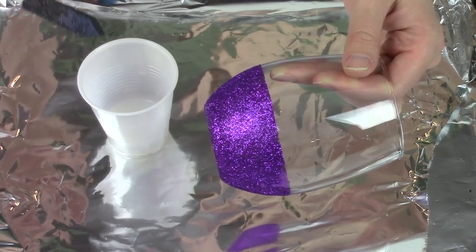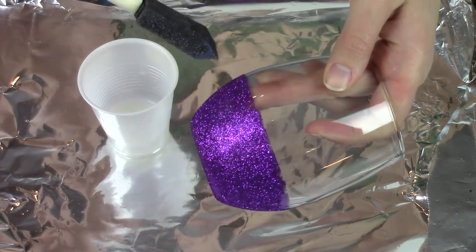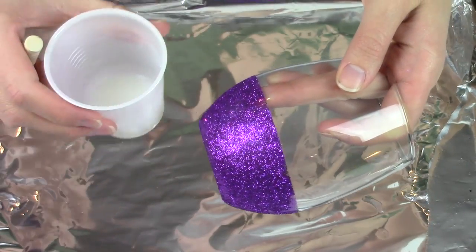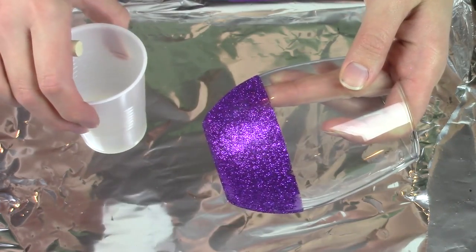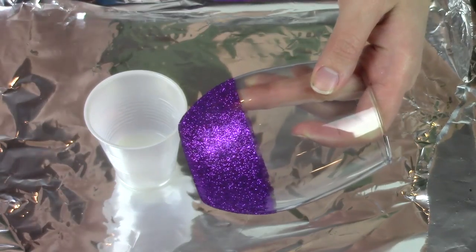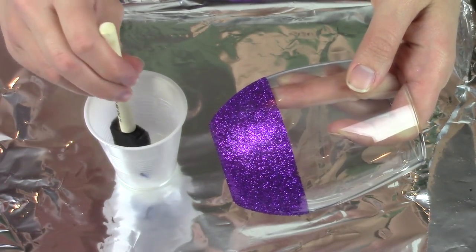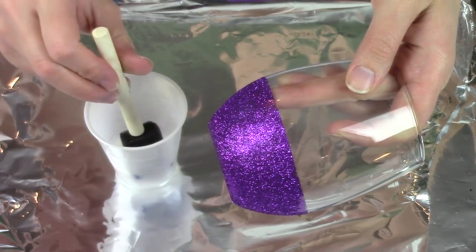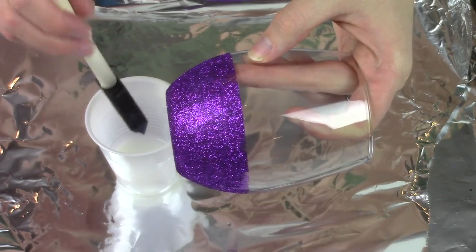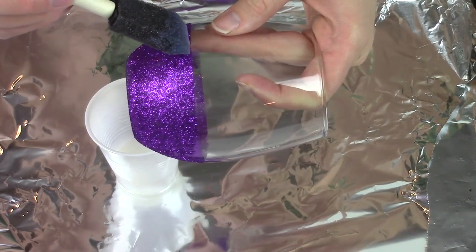This has been drying for about an hour and we are going to put a second coat of polycrylic on over the glitter. It's very important to have a small amount of polycrylic in a cup because you don't want to dip your brush back into your can — there will be just a few little specks of glitter on there. At this point, optionally, you can re-tape off your line if you're not confident that you can get close to the edge cleanly.